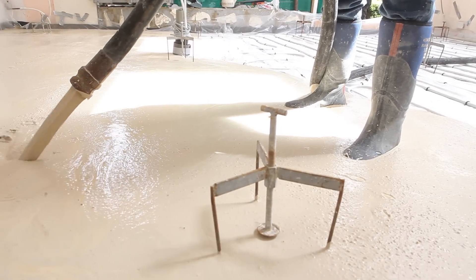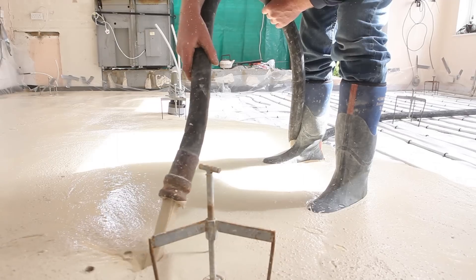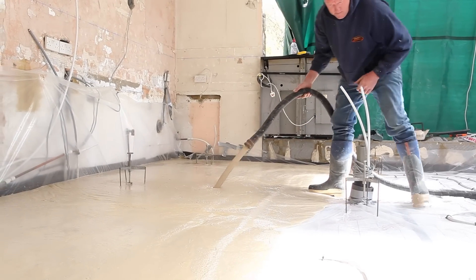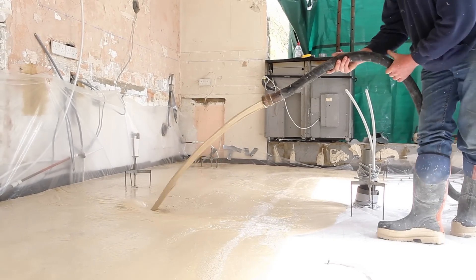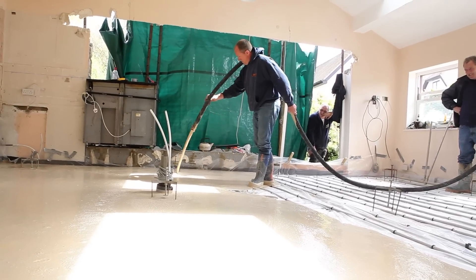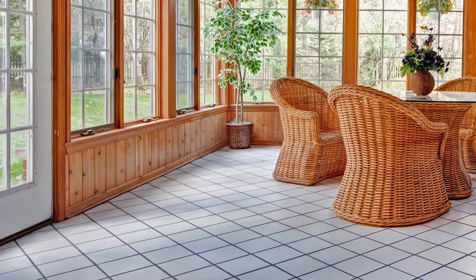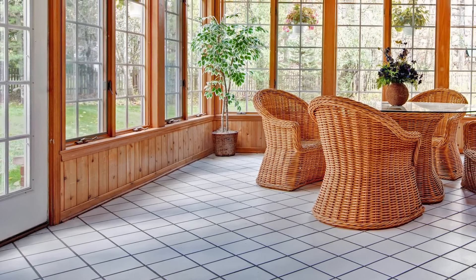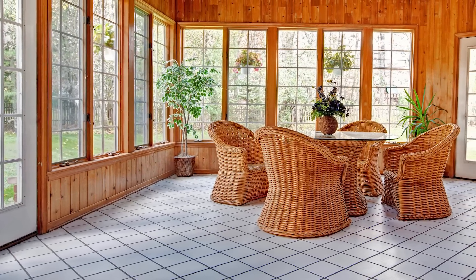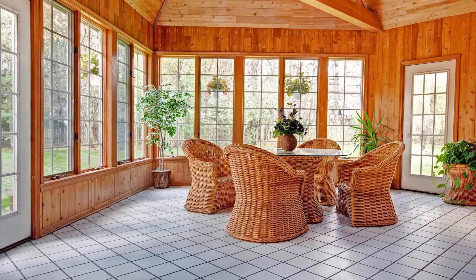Within the warm water underfloor heating systems you've got piping screed systems which are buried in the screed. For these I tend to use pump screeds rather than trail-down screeds because you can make those thinner, they're stronger, and the heating being slightly less deep in the screed is more responsive to temperature changes. One of the problems with underfloor heating is that if it turns out to be a warm day, your room is already warmed up and it can take a couple of days for the temperature to adjust — so around spring and autumn it can be a little unresponsive.